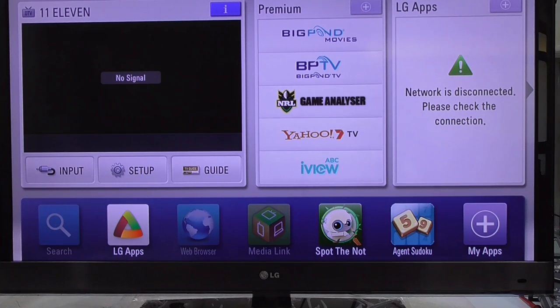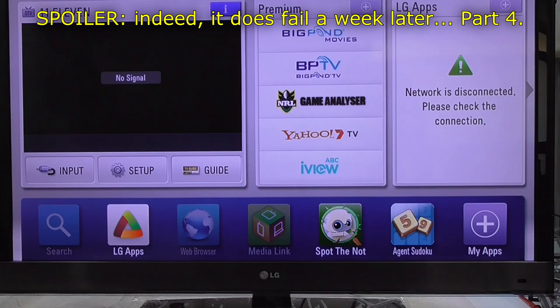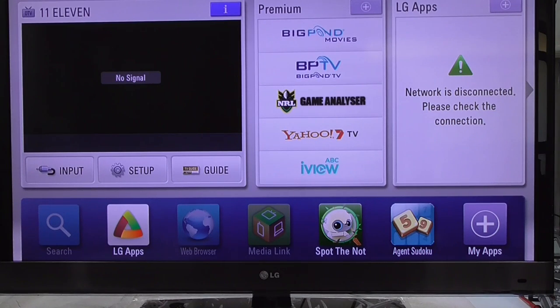Where it stands now is I'm a little bit unhappy with the reflow work I did on the BGA. I've still got those tinkering wires on the back I need to deal with - the two wire wrap wires fed out from the driving circuitry to switch on the inverter. I'll plug an aerial in and all that sort of stuff, run it for a while, and then probably do some tinkering with the firmware.